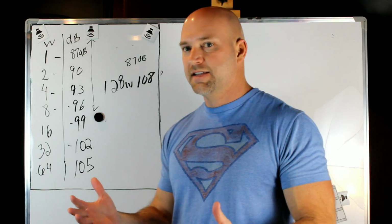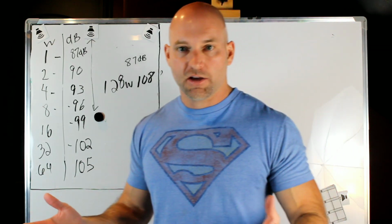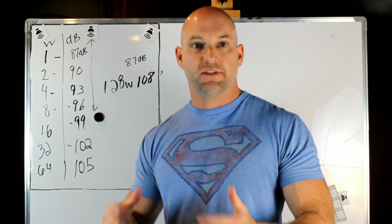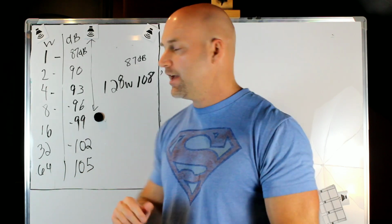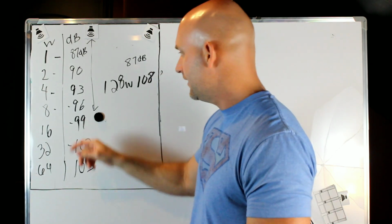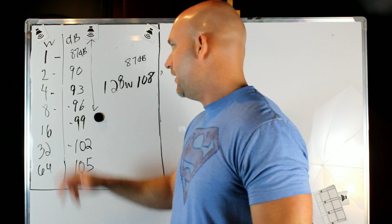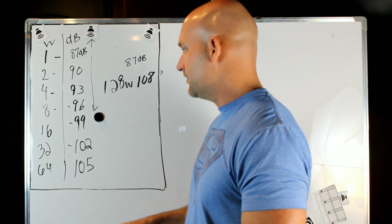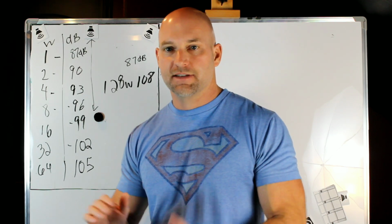So for me personally, like I said, I listen -15 to -20 from reference. So let's say -15 is as loud as I go, which is a true statement. That means I need peaks of 90 dB, 15 dB from that 105, which is what you get at reference. I need clean peaks of 90. I'm using a measly 2 watts, okay? Headroom, you give me some headroom, 4 watts. That's all I need. 8 watts is going to be 10 dB from reference, so like -10 on the dial. So you see we're using so much less power because our speakers are so sensitive.